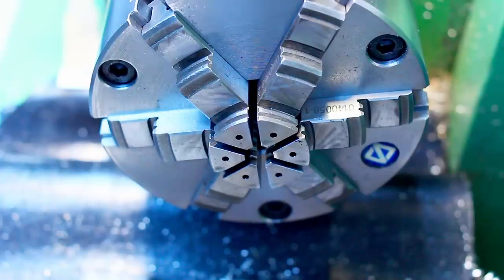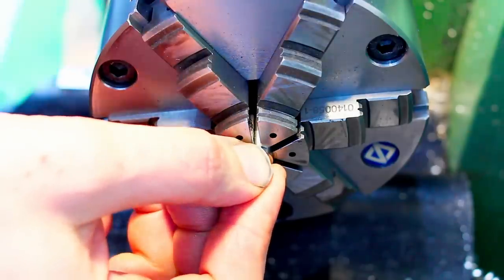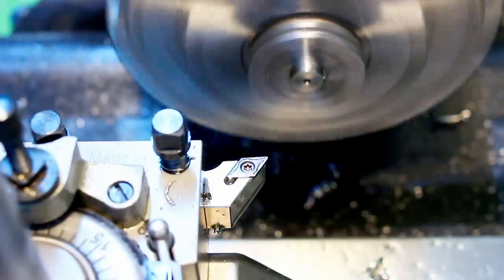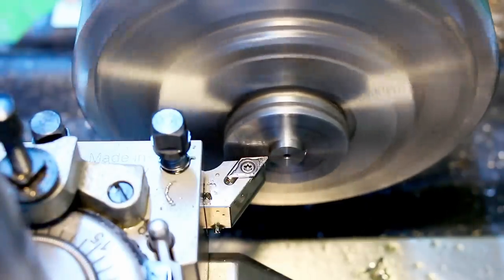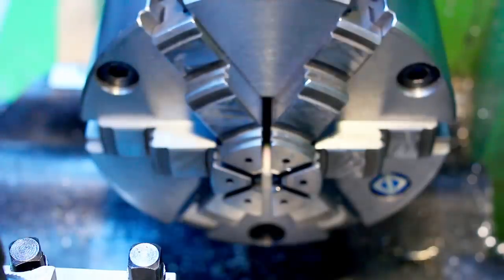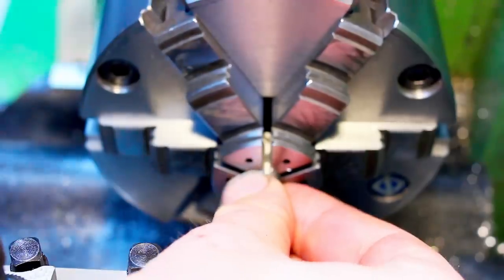So, okay, backside machining. We start just by putting these pieces back in the spindle and take a very light facing cut to get rid of the rather rough surface from the parting tool. So now we can take the part and check the overall length with a micrometer. So we have to remove 0.4 millimeters and a little bit. So the part goes back in way deeper than it would need for general machining.